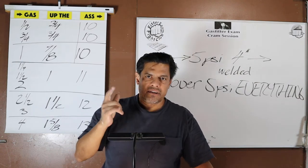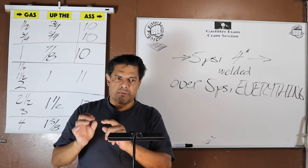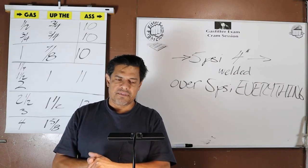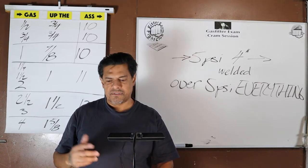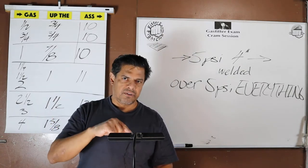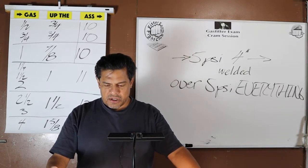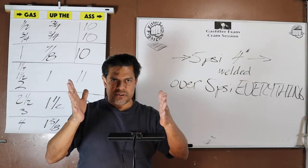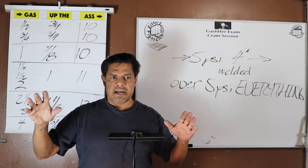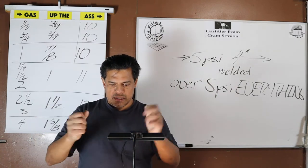And how do they know? You're going to x-ray that, and the little imperfections will show up just like those little black spots on smokers' lungs, you know? You've been smoking all your life and now you're coughing up a lot of stuff. You're going to say, uh-oh, the spot's right there. That black spot, that's the cancer. Well, on the weld, the black spot, that's a fail. They can also cut the pipe into 4 sections, longitudinally, lengthwise, and then they'll bend it to see if the weld cracks at the bend.